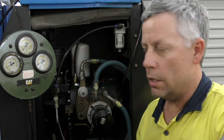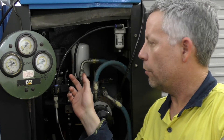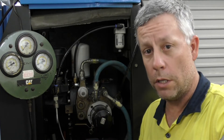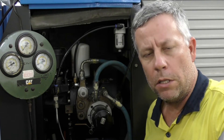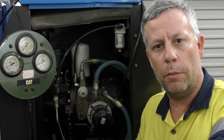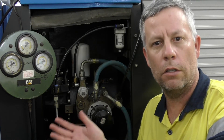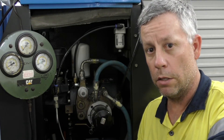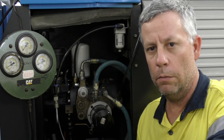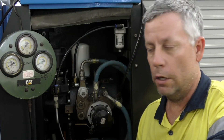So it's no wonder I'm seeing such a big drop when the compressor unloads - we're seeing 0.6 of a bar, and it's taking three bar just to get it from here into the receiver at free flow. In saying that, that is free flow - that might be a bit misleading because I had that to atmosphere, which is the maximum amount of flow you could imagine getting through that line when there's no restriction and it goes straight to atmosphere. Of course you're probably going to see the biggest pressure drop through the hose there. But you could well imagine it's still got to be better than that, surely.